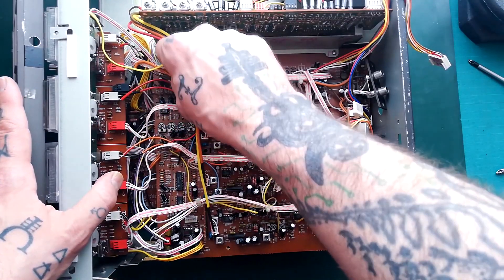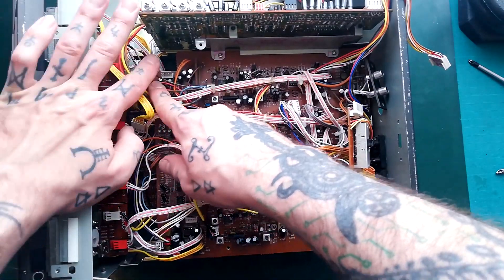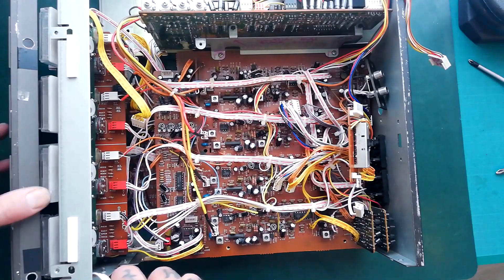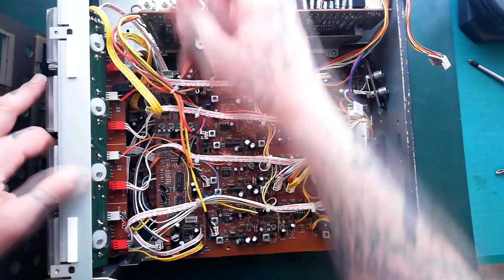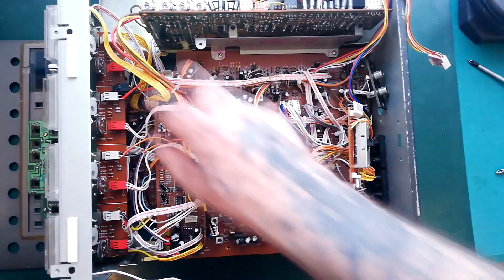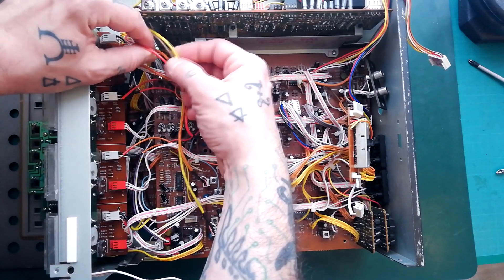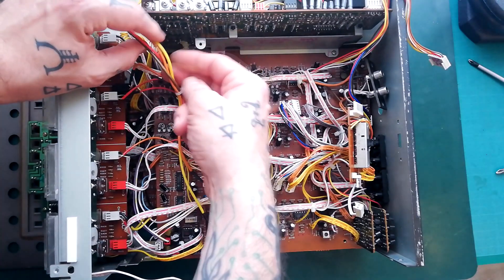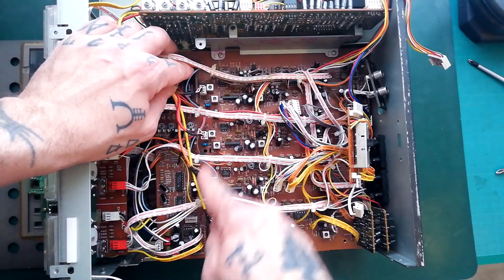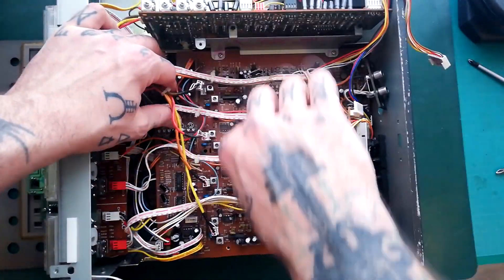At the other end there's a yellow ribbon of cables — another five-pin. You can see this little L-shaped cutout and the group of capacitors here, with the header right there. There's one more cable attaching those meters — I'll detach that later and leave the meters in situ for now. We've got a bunch of four thick-ish cables: red, orange, blue and yellow — that's brown one, red two, orange three, yellow channel four. Those are splitting off into three thinner cables into headers distributed along here. The individual cables are quite fragile so I pulled those out with pliers.